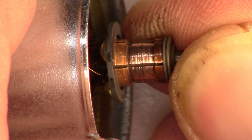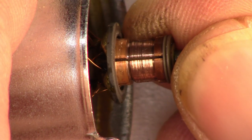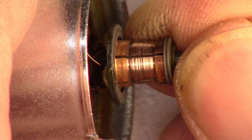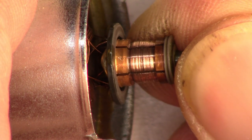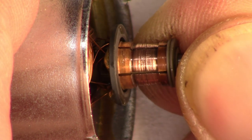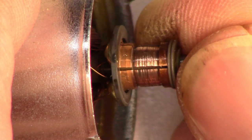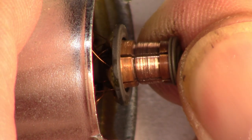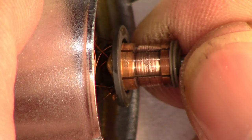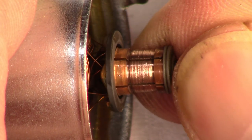You can see where the continuity is and is not — that one has continuity, you can see the shininess. No continuity right there. That one looks good, still connected, but right here it's totally open. You can definitely see where the commutator has been broken. It's worn all the way through — there's no bringing this one back to life. Allen Bradley fail — you just did not design this thing well for continuous rotation use.